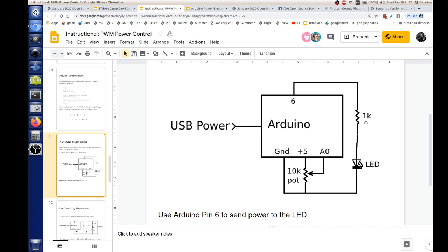So let's start. We have 5 volts, and we subtract from that 1.2 volts. That gives us 3.8 volts. You remember the formula from above: voltage equals current times resistance. The converse of that is that the current is going to be the voltage divided by the resistance. The voltage across the resistor is going to be 3.8 volts, so we divide that by the resistance, which is 1,000. That gives us 3.8 milliamps, and that's going to be the current going through the LED to make it illuminate. As I said, these are very simple formulas, but they're also very useful.